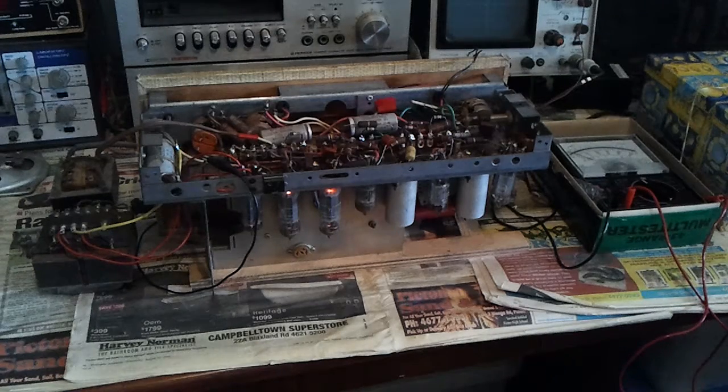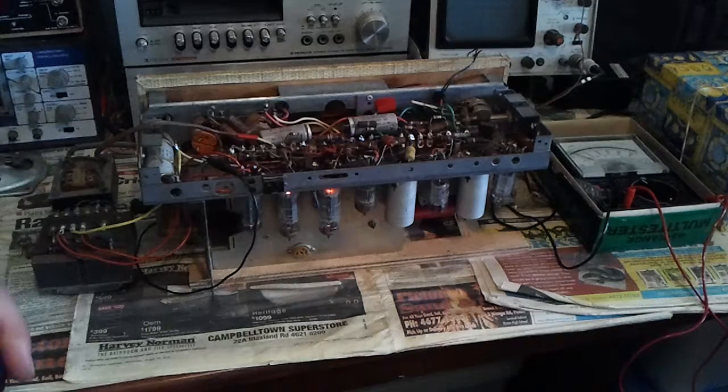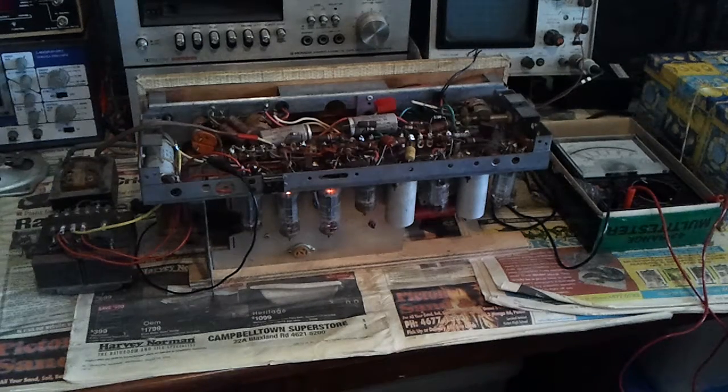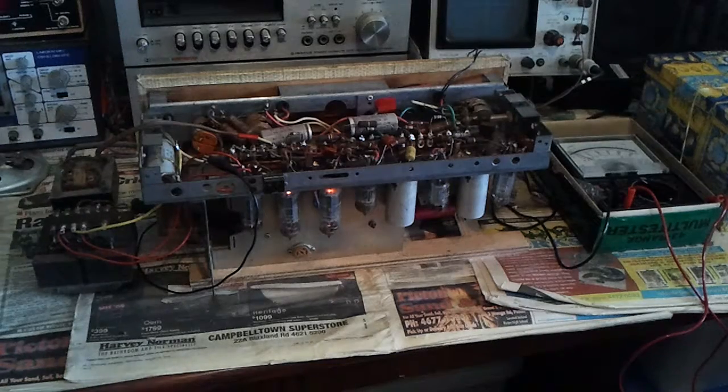And in this case too, the meter I've got on the right hand side there, the analog multimeter, has a range doubler switch. So if you're on the 10 volt range, the sensitivity goes down to 5 volts. So when I'm operating on half high tension for this, with that range doubler switch, you can almost make out that the readings are in full high tension, so you can get the same volts as you would if you're running at full voltage.